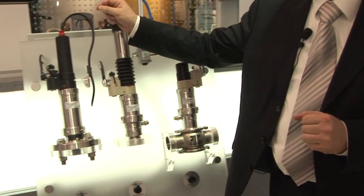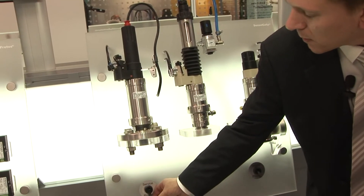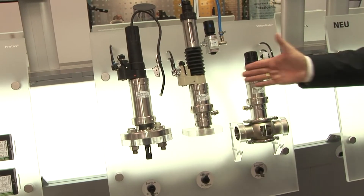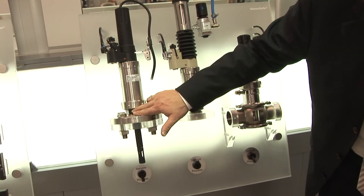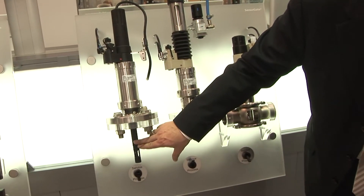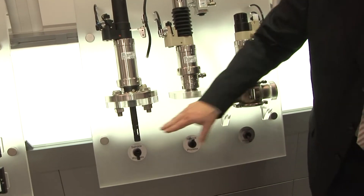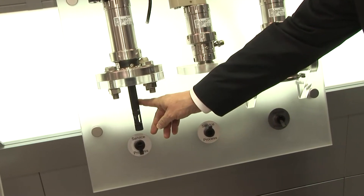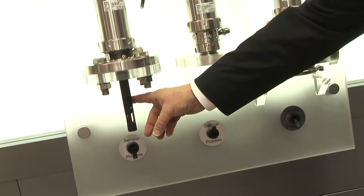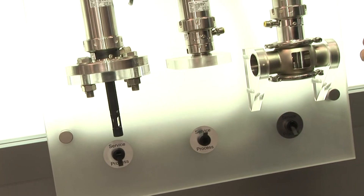Here you can see we have a complete family of pH holders, with a long immersion depth. This is pneumatically operated, and in the lower part you can see that we have PEEK material filled with carbon fiber. The carbon fiber and the PEEK material together have a tightness almost like aluminum, giving us very high chemical resistance against high temperatures and against high or very low pH values.